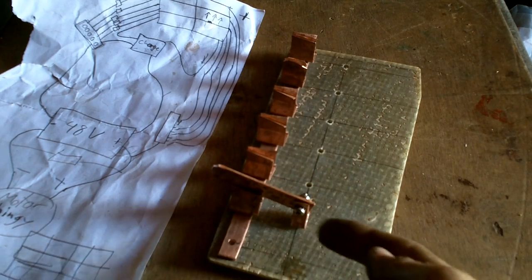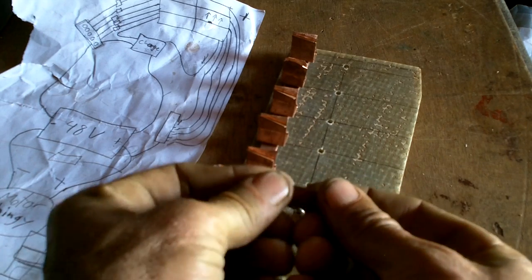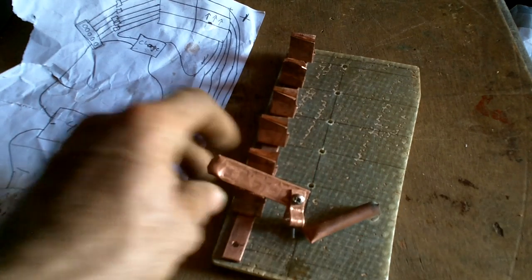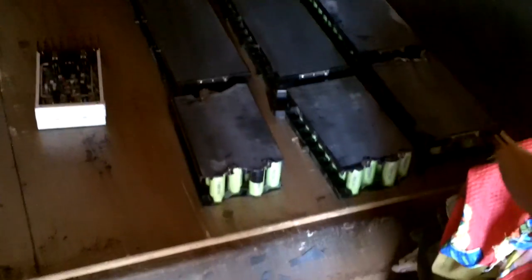So I already have all the wires that are going to be coming into here on the boat. I'll strip the ends, stick them in pieces of wire like this, crimp them closed, flatten the end, drill a hole through it, put it under there, screw it in, and Bob's your uncle and Mom's your name or whatever. I don't know.